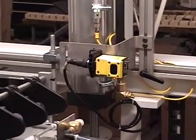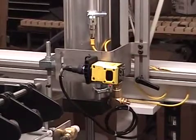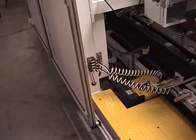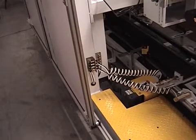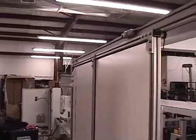The full grid PE3i has been modified and is now mounted on fixed aluminum 80/20 rails with adjustments for horizontal and vertical positioning. This provides for increased stability and eliminates any photo eye flickering. New Omega direct drive couplings are used to replace number 60 roller chain and sprockets and are located on the wear conveyor, case feed, and flap opener case feed assemblies.